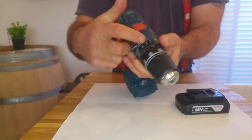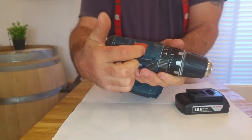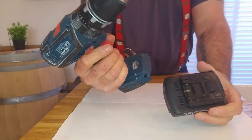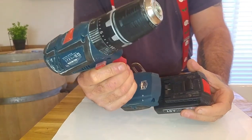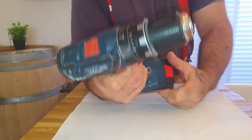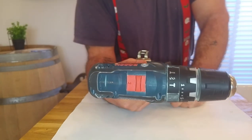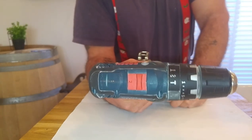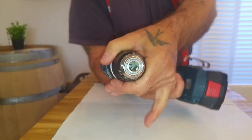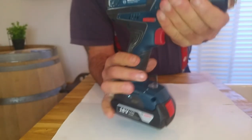It's got the screw setting, then the drill, and then the hammer action — two speeds, one and two. The batteries on mine are only 1.5Ah but I believe you can get them with 2Ah now. This is the Bosch Professional GSB 18 II LI Plus and it's a keyless chuck that handles up to a 13 millimetre drill bit.